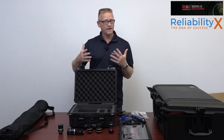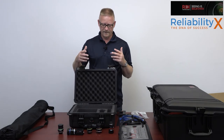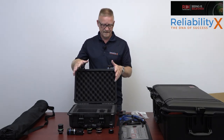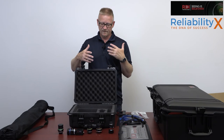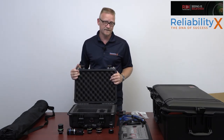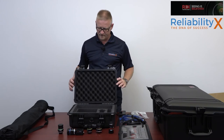So why so many lenses? Each one is a fixed lens. Based on how much you need to zoom in, a fixed lens is much higher quality than a zoom lens — if you're a photographer, this makes sense. Because you're trying to get very accurate displacement measurements, you choose the correct fixed lens based on your distance from what you're photographing. That's essentially everything included in the standard kit.